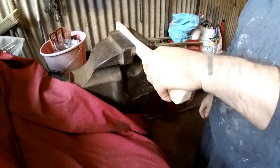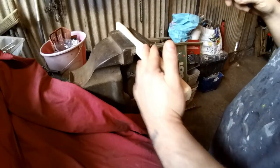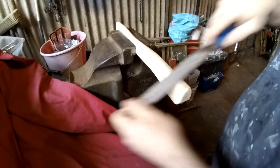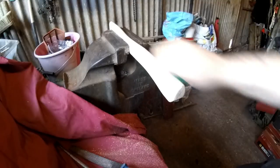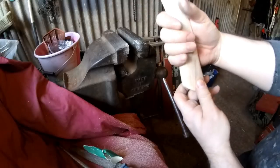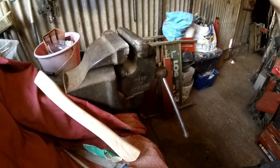Right, as I said, this isn't a bad bit of wood for the handle. Does seem like a decent bit of hardwood. So I'm going to shape this bit round now, because it's a bit square on the back, I think. So I'm just going to use a rasp file and then a smoother file and a bit of sandpaper. Hopefully this shouldn't tear this out too much. Don't know how well you can see that, but much nicely rounded now. Not a lot really needs to be done to that handle. So I'll do the lanyard hole now, and then we'll see how the nail varnish is getting on with the head.